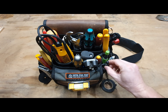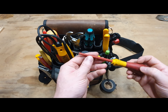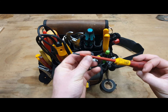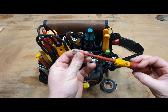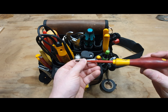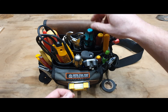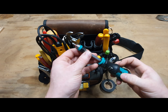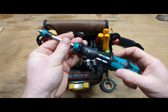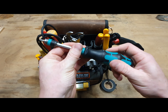On the front here I've just got a four-color pen, a texta for marking cables, and a Sharpie pencil. This is my terminal screwdriver — I usually go with the slimline ones, but this one is small enough to get into the holes and the shank's a lot bigger so it's a lot stronger. It's a 4mm — 0.4mm. This is the multi-bit driver, just got a small Phillips in there at the moment. Pop the cap and there's an assortment of bits — Robertson, a couple of Torx, and a few hex drives.